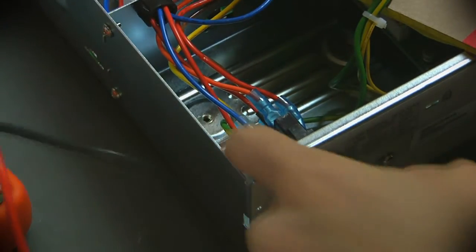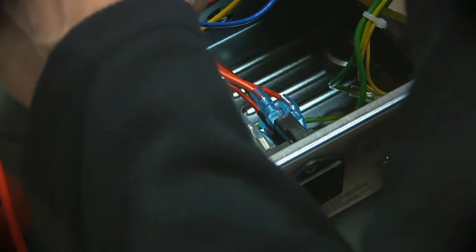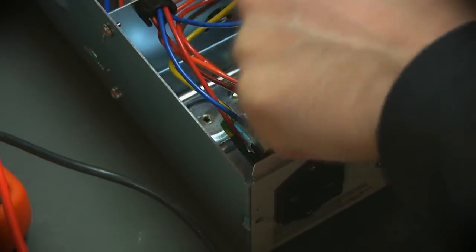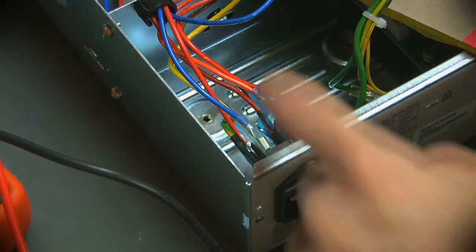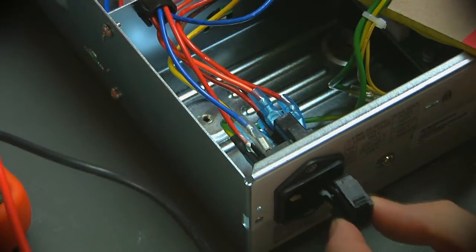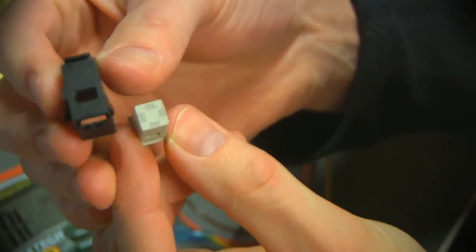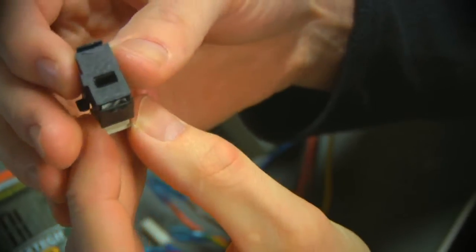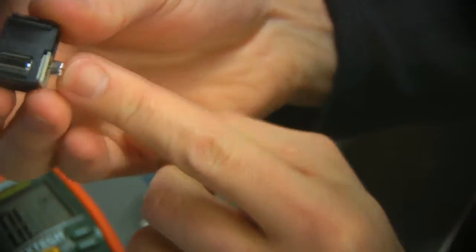Really trying to unwind what's going on with all of this business coming off of the fuse block here. So this red line that comes back from the main board connects here in the center, and then the 4 different primary taps are sort of arrayed around that. So again, here's the little fuse cartridge. Once you take it apart, this little insert you just turn 100 volts, 240 volts, 220 volts, and when you pop it in, it just places this little brushed contact on the correct side.